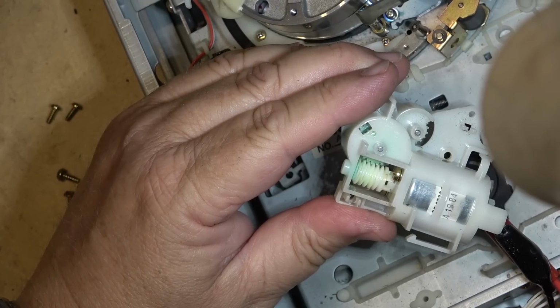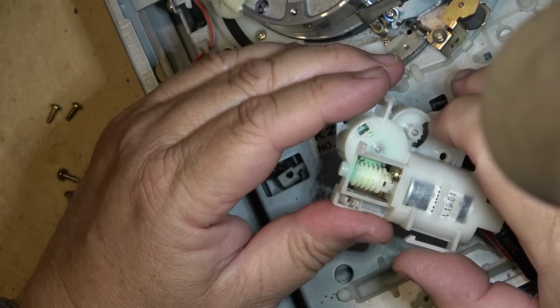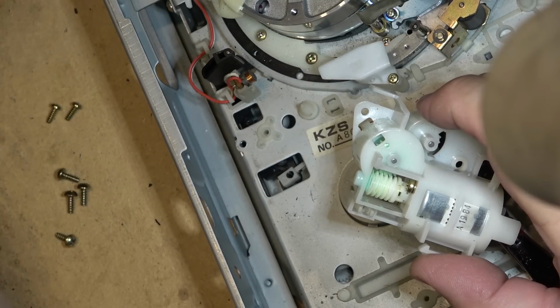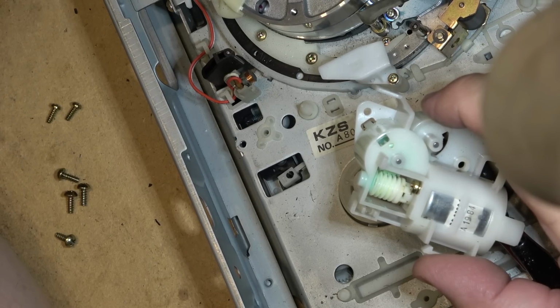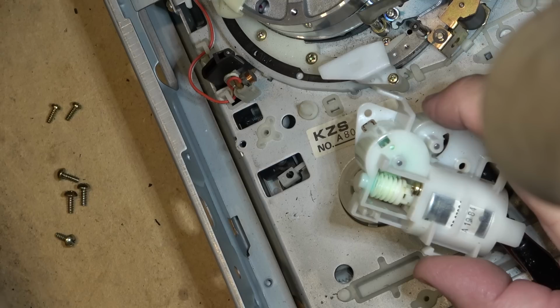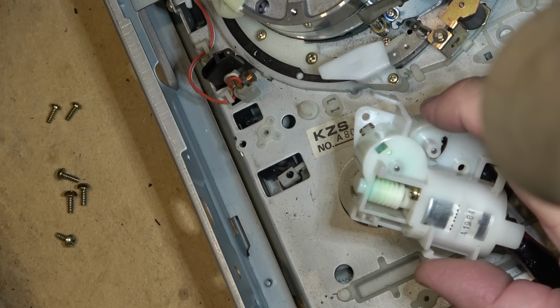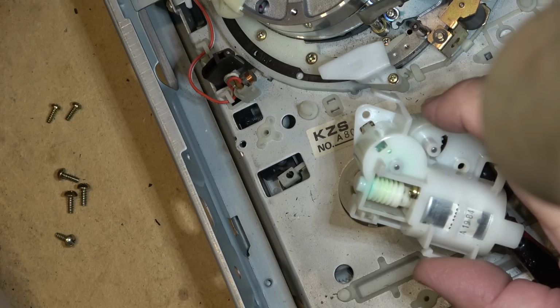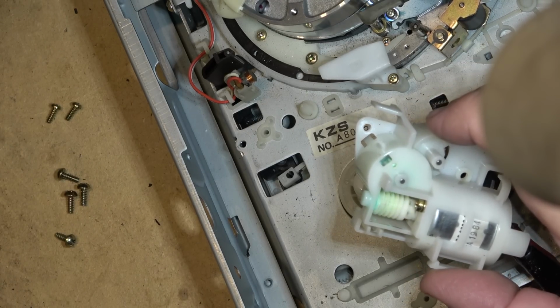So there we go. I was able to stall it. It's still got power applied to it, but it's not turning. Even if I give the voltage a little bit higher, I'm now at 2 volts, 3 volts, 4 volts. Okay, it is dead to the world unless I give it a nudge, and then it goes. So the motor's got a dead spot. That's what is the problem with this one here. So let's just see whether the other motor will actually swap out for this one.